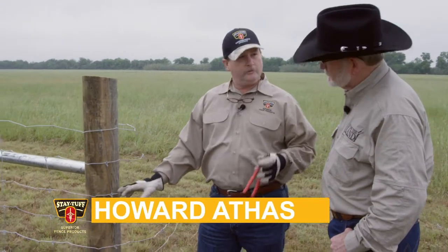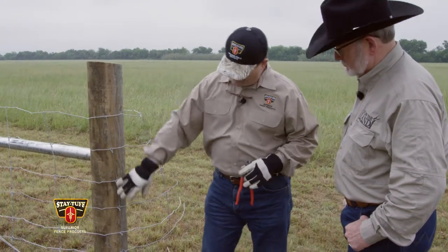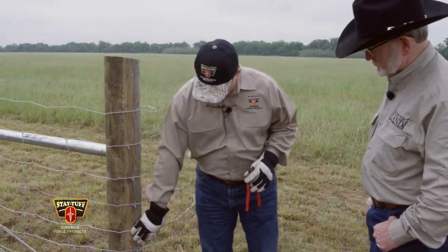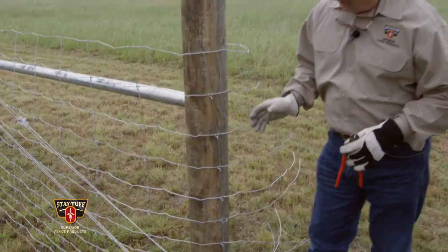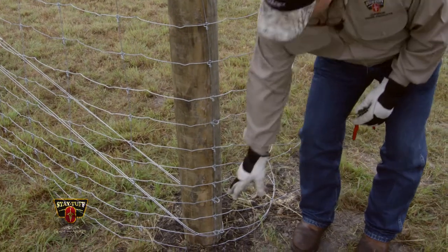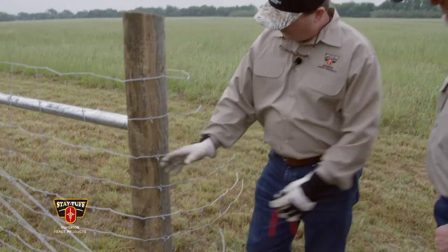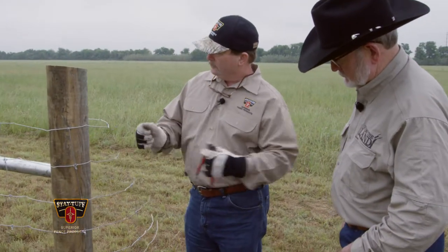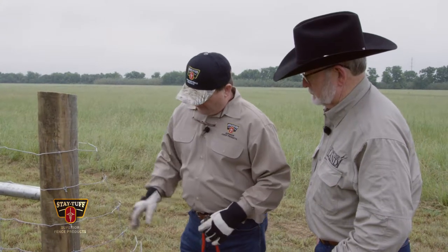What we'd like to show people to do initially is get your wire with the stay on the back side of your post and stabilize it so you don't have to fight with the wire pulling against you when you're trying to tie it off. One way we do that is to apply a couple of lightly driven-in staples through the bottom corner of a knot, and that holds it in place so you don't have to keep working against the pull of the fence down the line.